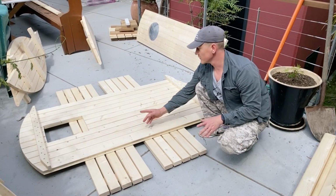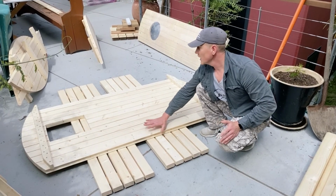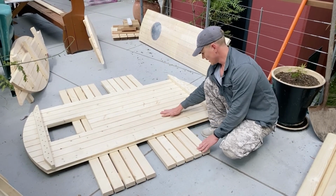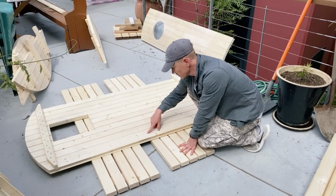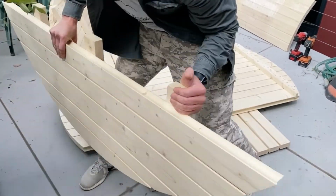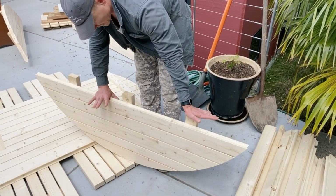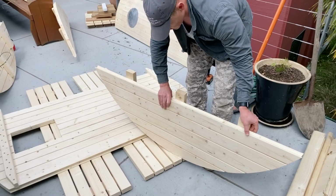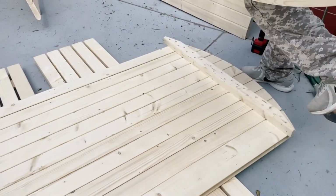Each wall will be made of 3 pieces and they are pre-assembled in the factory. So when you get your kit, it will be 3 pieces: the middle section and 2 side pieces. Now please pay attention to the pre-drilled holes for the screws. Because there are four sections like this, 2 of them will be for the front wall and 2 of them will be for the back wall. So there's only one section that will fit the particular spot. So you see that this is the concave in, and that's the one that will go on this side.